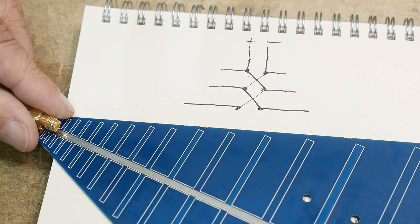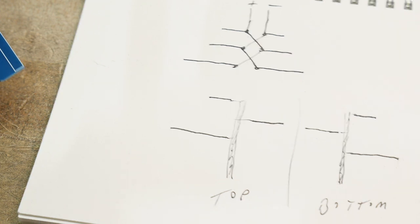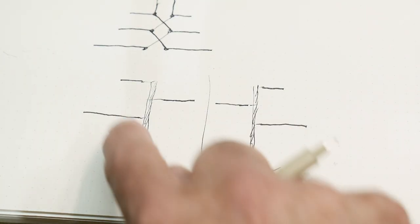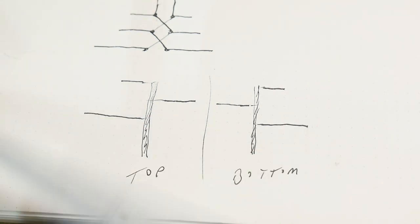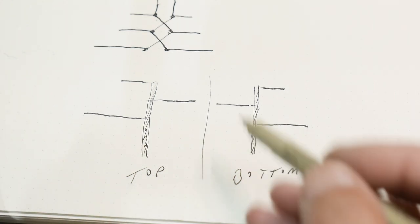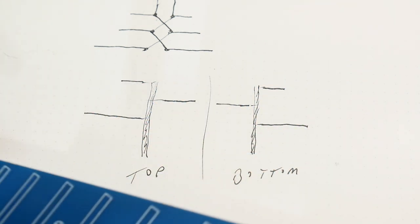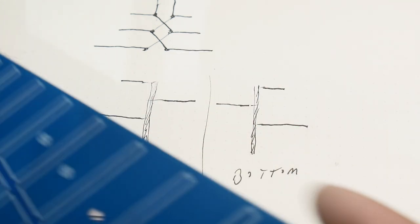And the way that they accomplish that is to have the top of the PC board have elements that look like this, and the bottom of the PC board have elements that look like this. And then when they're on top of one another, they end up being that up there, okay? So one side is ground and one side is signal, or you know, positive, negative, or center connector. Anyway, it should be fed ideally with a balanced feed line. So the more accurate way to say it is there's just a left side and a right side. No such thing as ground, no such thing as signal. It's just one side of the transmission and the other side of the transmission. And that's the way it propagates.